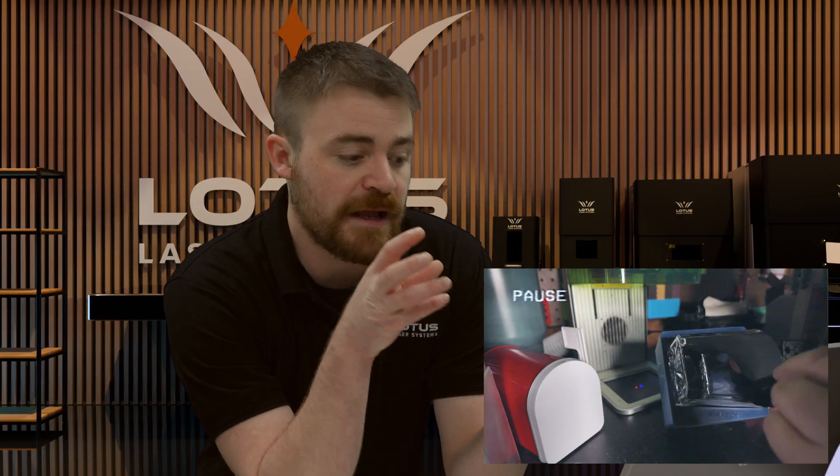What they're doing here is covering the surface with something like acrylic paint, which can react with the diode laser. When it does, it generates heat, and that heat then transfers onto the glass and leaves you with your mark. In theory it works, but in practice you have to make sure that the paint is incredibly evenly spread, because if it's thicker in some areas or non-existent in some areas, you're going to have a mark that gets really patchy.